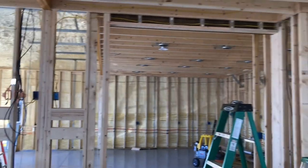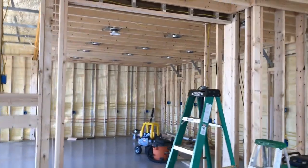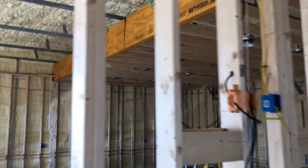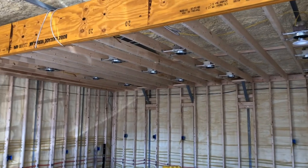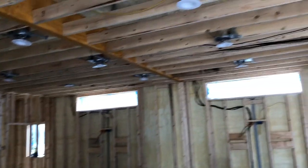That way it's taking the warm air from inside and recirculating it into the building. Hopefully the idea is it'll kick on, suck the hot air out, dump it out here, and then potentially these 2 mini splits out here will pick up the difference in air temperature and kick on to cool that air that was just dumped out here. So that's kind of the idea.